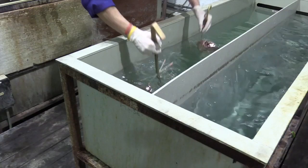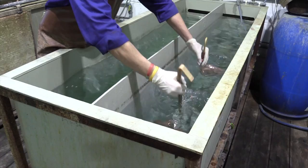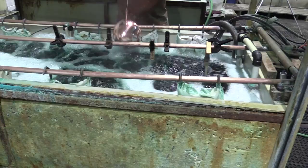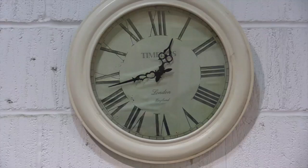The parts are then again rinsed in clean water before being transferred to the bright nickel plating solution. Once in the nickel plating solution the current is applied and the plating time decided. In this case about 50 minutes of plating was chosen to ensure good corrosion resistance.